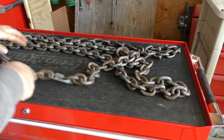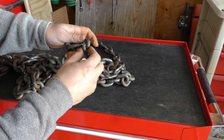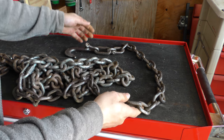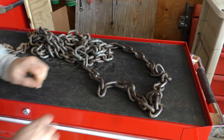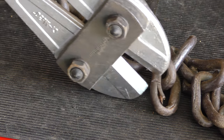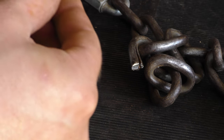Continuing down the chain — the link we just did looks good. The heavier part of the chain is all good. This next link doesn't look terrible, but this one — wow — looks bad, with chunks missing out of it. The rest looks okay, so we just have one more spot to fix. That really is a nasty-looking link. We could leave it and wait for it to fail, but I'd rather replace it before it fails. There are chunks of it just flaking off.